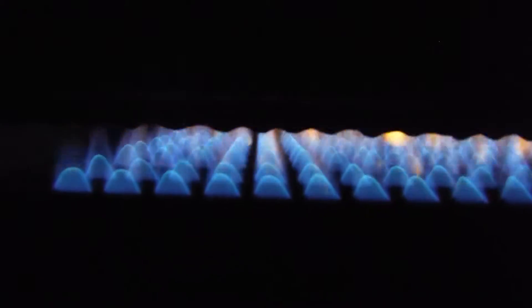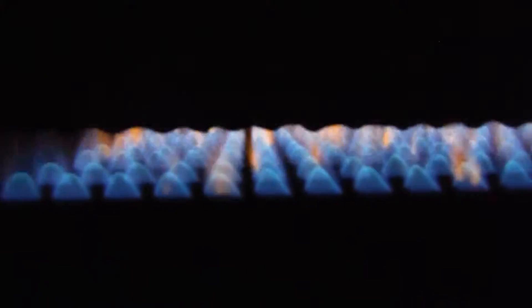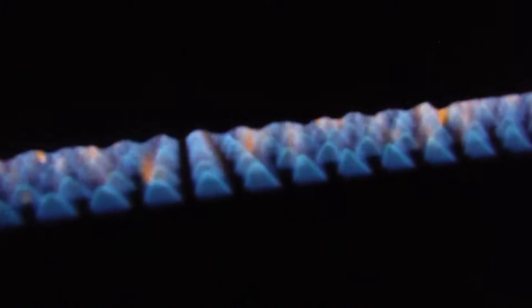There goes the house fan. The house fan is going to make any cracks in the heat exchanger really stand out because the flames will start dancing. These soldiers actually, very surprisingly, look extremely well.